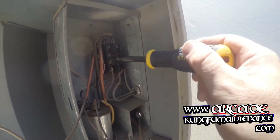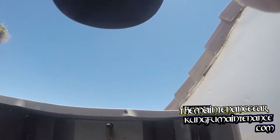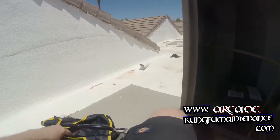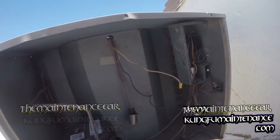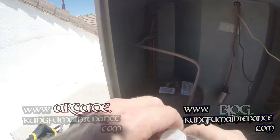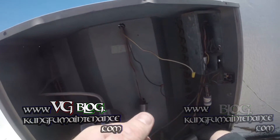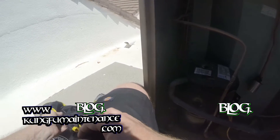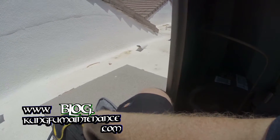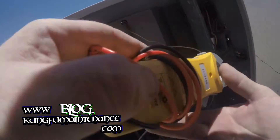Our wiring is okay. So this one was kind of interesting. The air conditioner fan motor was working but the compressor was not working. What it actually turned out to be was a burned wire. The interesting part was that the fan motor was actually working — it was running and everything, no problem. But when I tested it, the microfarads were at 50% of what they should have been. They were about 2.5 and it's a 5 microfarad capacitor, which has a rating plus or minus 5%. Kind of interesting that it was actually still running even though it wasn't running properly.